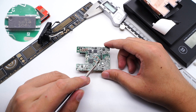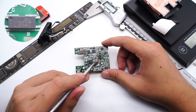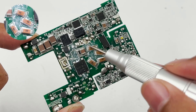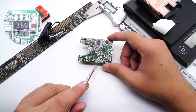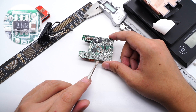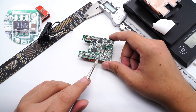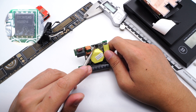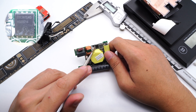Here is the transformer. The optocoupler adopts Everlight EL1018, used to communicate and regulate output voltage. Here are four MLCC capacitors. The synchronous rectifier controller comes from MPS MP6908A, with a maximum switching frequency of 600kHz. It supports different working modes and can work with standard and logic-level synchronous MOSFETs. This synchronous rectifier adopts Infineon BSC093N15N-S5, which uses the TO-TDSON-8 package, 150V, 9.3mΩ.